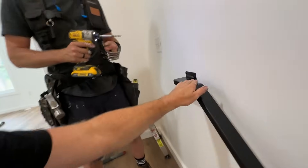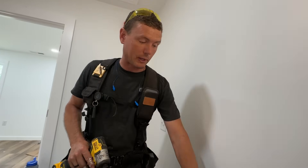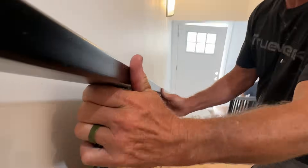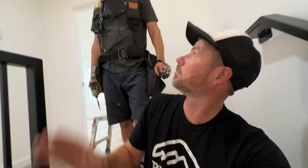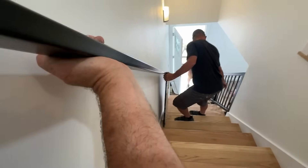For viewers — what's the reason for this little flat run at the top? You might want to grab onto the handrail before you take your first step down without reaching down to get a hold of it, so a little flat section at the top solves that. It's a lot of work for a small feature, but I really don't like the way a straight run extended up would look — it would get too high. It does have the tiniest bit of sag overall, maybe a quarter inch. We could add a bracket in the middle to get it straight, though without brackets it's amazingly strong.